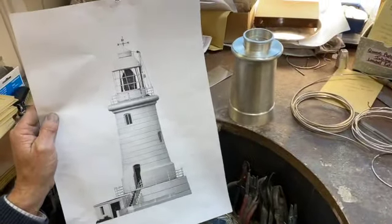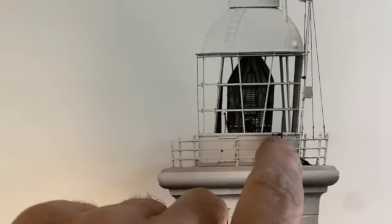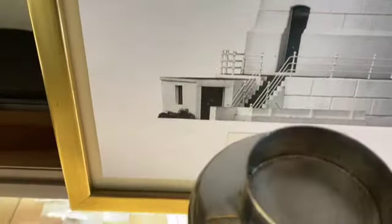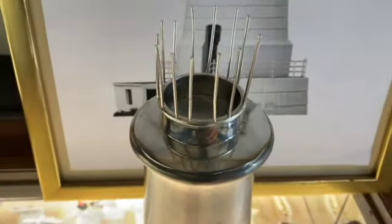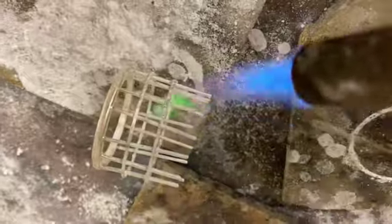It's all coming together very good. You've seen me before making this little rim up that goes around here. What I've done is drilled it all out and silver soldered these wires in. Some are wider than the others — some are on a taper going up and some are on a taper coming down. So I've got my little piece here and this is the section that's all got the pieces over. You can see they're not straight yet until I get them all done correctly. But what I will do now is fold those correctly, get them all the same height, and then I'll make the top section up. Now I've got the first little ring on — I'm just going to solder it there to tack it, and I can bring the other one off and then level all the tops. So now we'll just put the second ring on, pack that one down, and then I'll level these other pieces up.